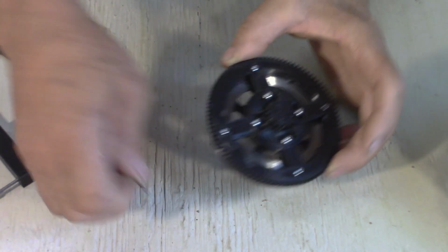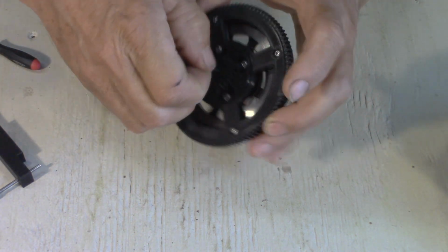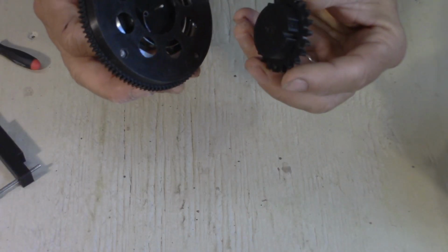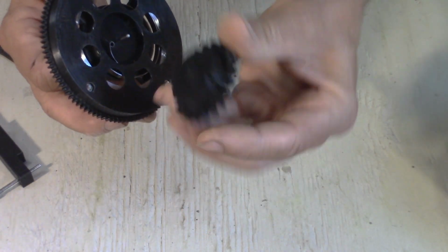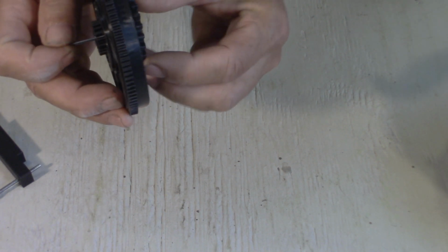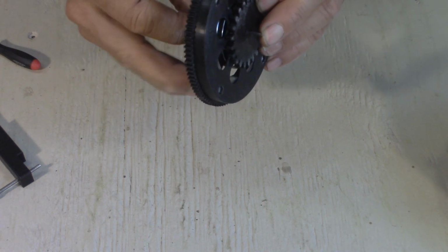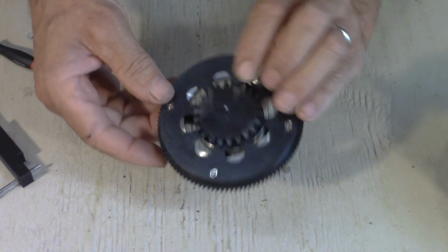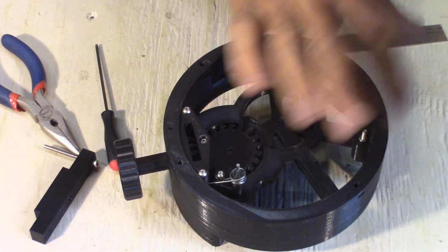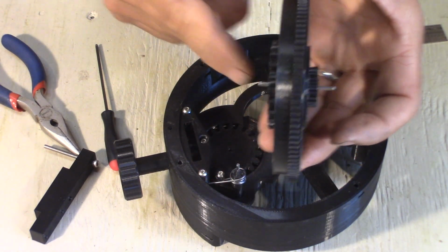That's for the barrel. Make sure the barrel spins on the pin. Engage the notch and the spring, and then push the pin through. That's ready to install. And then I put this in. I have the arbor in the barrel.